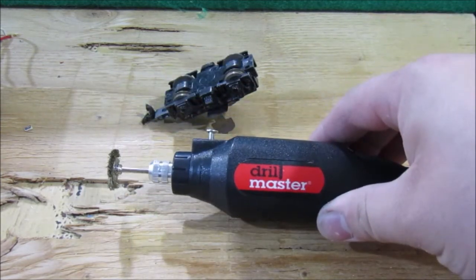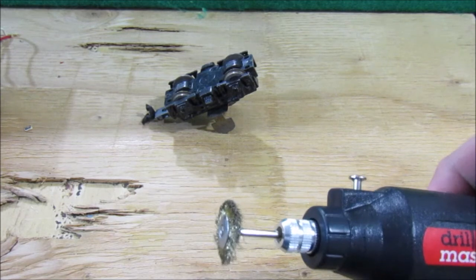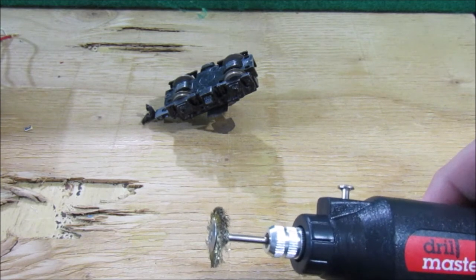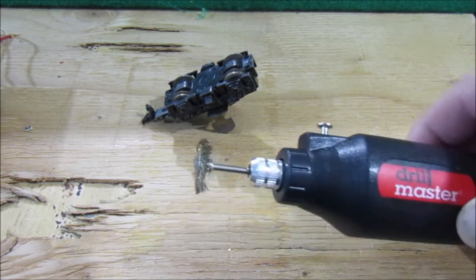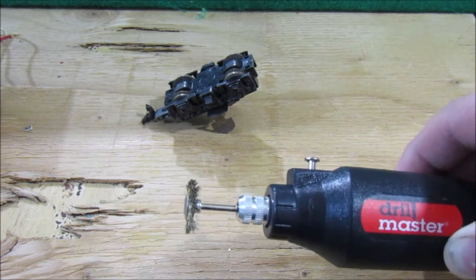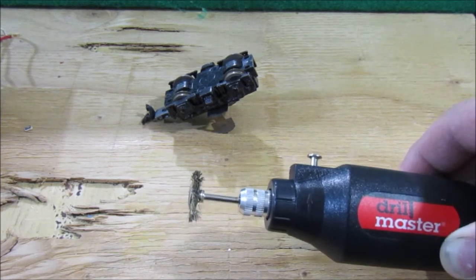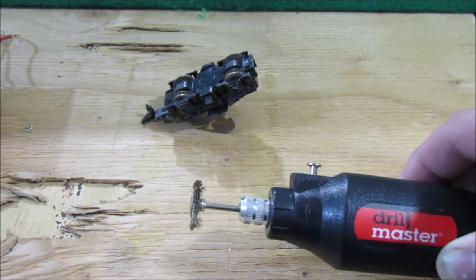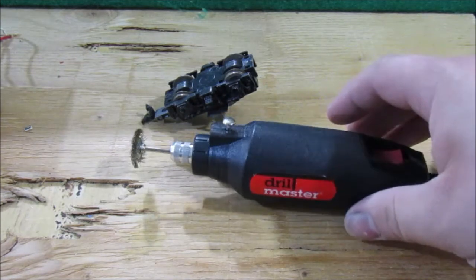It'll make your life a lot easier when it comes to cleaning dirty contact wheels. Specifically, you want to use the wire wheel attachment. I found that this makes cleaning corrosion off of dirty contact wheels the easiest, because you're not really going to deal with any rubbing into the wheel like you might with sandpaper or anything rougher. The main purpose of the wire wheel is to clean off corrosion or rust off of a surface. I'm specifically talking about contact wheels with basic corrosion over time, not heavy duty issues like zinc pest.